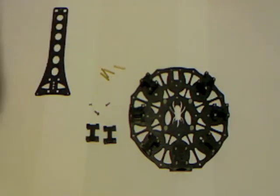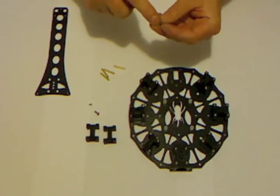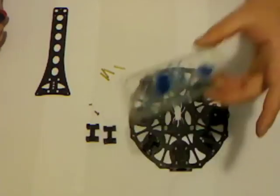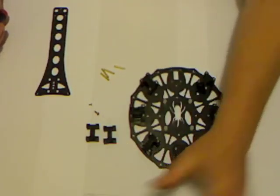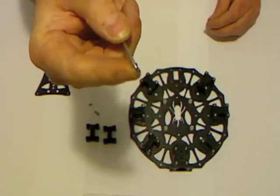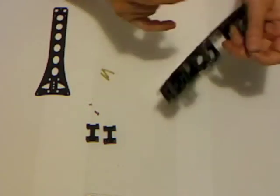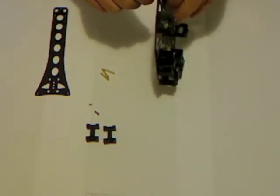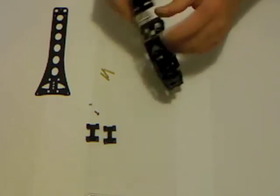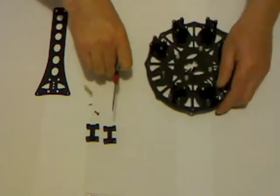Alright, so grabbing my multi-rotor tool and one of the 8mm, the M2x8 screws, tiny dab of Loctite on the end of the screw. What I like to do is actually put my Loctite on any sort of scrappy bit of plastic I've got. Then I can just dip in. That's actually probably a bit too much of a blob of Loctite, but anyway, here we go. So what I like to do is 2 pins at first, and I leave them a little bit loose. Right, now for this back mount you need to do the inner 2 pair first.